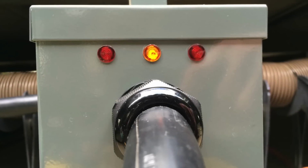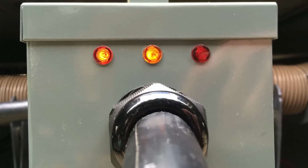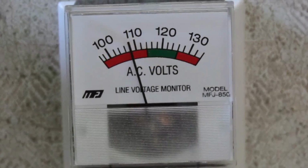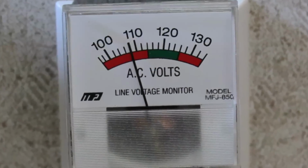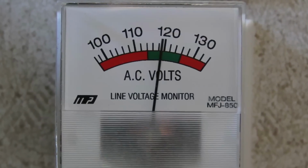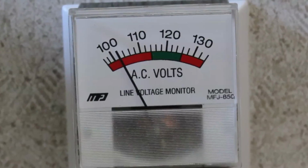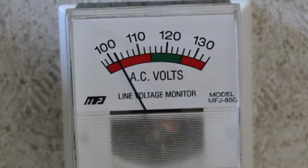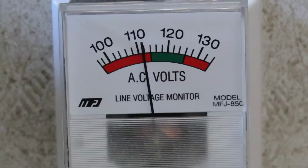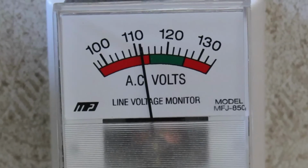When park power drops below 114 volts, the Autoformer really shines by automatically boosting power a full 10%. With the pedestal we're connected to today providing only 108 volts, voltage gets boosted to about 119 with it plugged in. When power really starts to drop, like in this park, where we're only getting 102 volts, the Autoformer's 10% boost takes us up to 112. That's enough to protect our RV and equipment from the damage that very low voltage will cause over time.